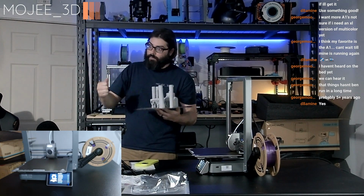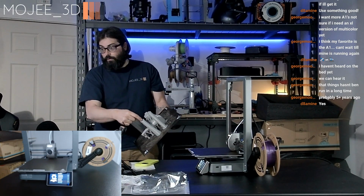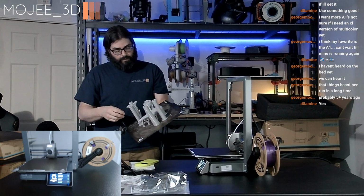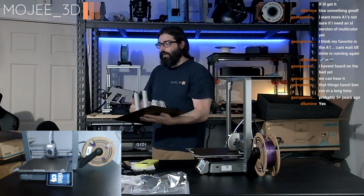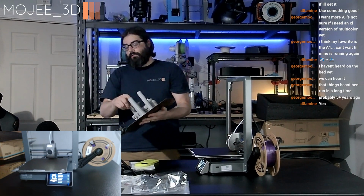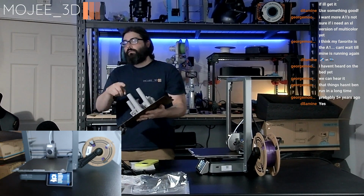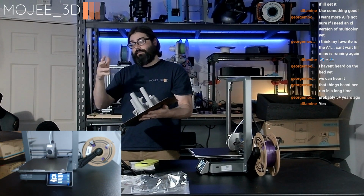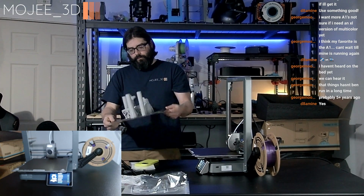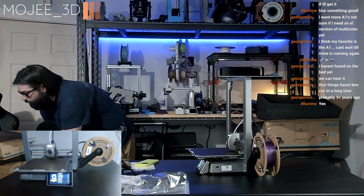So she has the hammer and the axe. The way it's designed is it takes a 1/2-inch wooden dowel all the way down through it after you get it all put together, so it's really rugged, really strong. On the X Max, it's printed in like 10 hours, and I didn't skimp on the settings. This is 4 perimeter walls and 15% infill gyroid, and it's still printed in 10 hours, which is pretty good. I'll print the axe at some point, probably tomorrow.